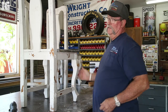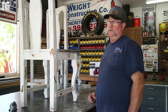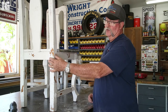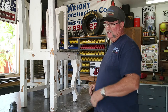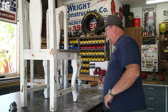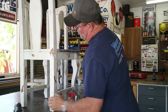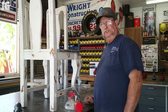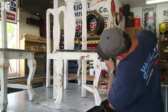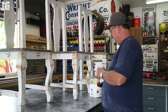The putty has dried up a little bit. After reading the instructions, this is extremely fast-drying putty — it dries in about 15 minutes depending on the thickness. I let it set for a good hour to an hour and a half and it's hard as a rock. It does shrink quite a bit though, so we'll probably need to sand it all off and I may need to do a little more filling. I've got my Milwaukee five-inch orbital sander and a Craftsman detail sander here, so between those two we should be able to smooth everything up real nice.